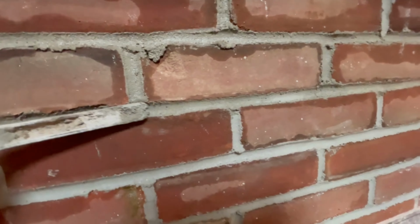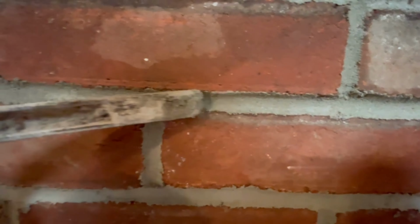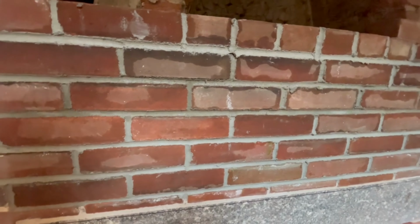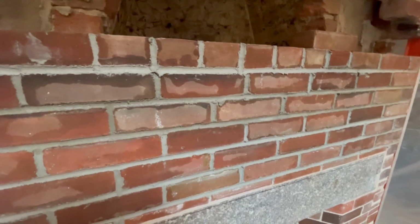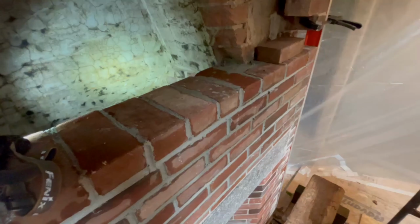And this grayer mud is more gritty, and you can see the little particles want to fall out of it and kind of pull open more. See, it's more open, and now I come down here and it's smoother. So the lime makes it stick a little bit more, and it also makes it a lot nicer for joining. So if you want easier mud to work with, easier joining, just add a little bit of hydrated lime to it, it goes a long way.